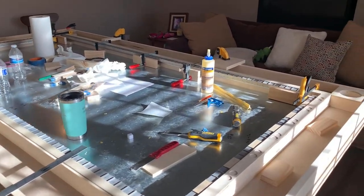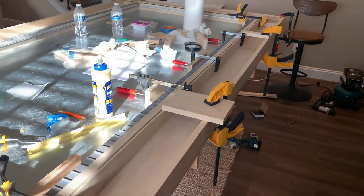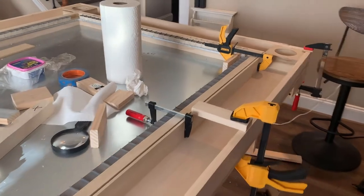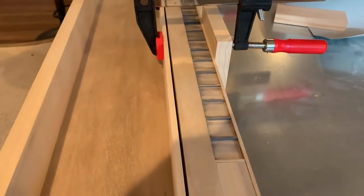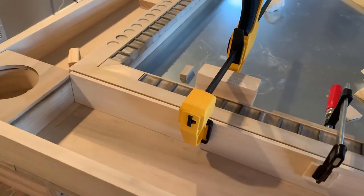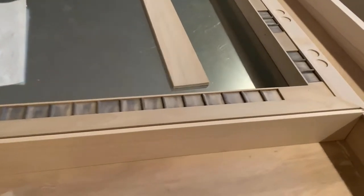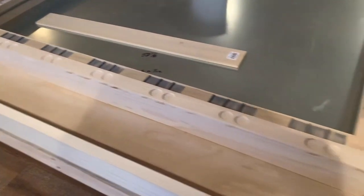Next I put two long finish boards where the teams will sit on each side of the table. You can see that gap — the player will use that gap to place cards, money, or anything they want to keep out of their trays. Then I wanted to cover up the IPC trackers from the inside, so I cut four strips of finished wood and glued them up on all four sides. I also had to create those corners where the IPC trackers ultimately join together, and I took my time to ensure those blocks came out with a nice tight miter.